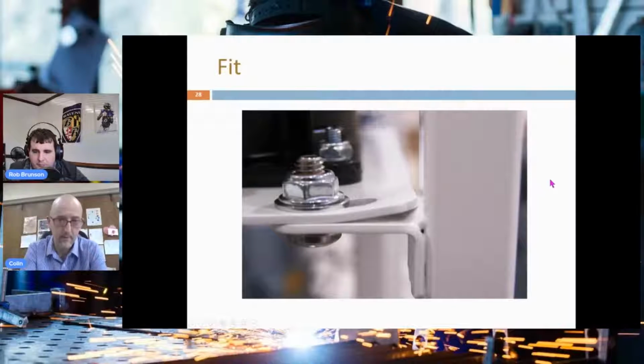You've got this big issue here, and I said, I'm really sorry that we did this. I didn't intend to, obviously. We came back and looked at the print, and the parts were made per print. What happened was, in the SolidWorks design, the weld bead was not accounted for. So it was just this right angle bracket put up against the tube, and the weld bead was not laid in. So nobody in the design step observed that there was going to be this interference issue.